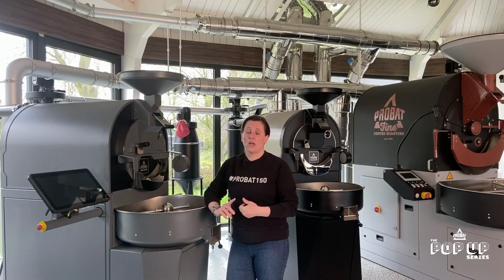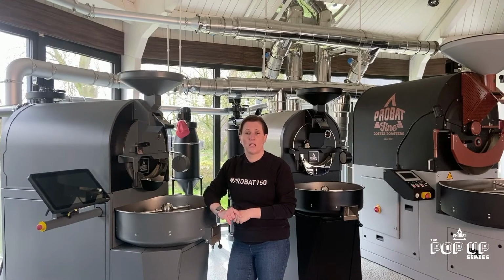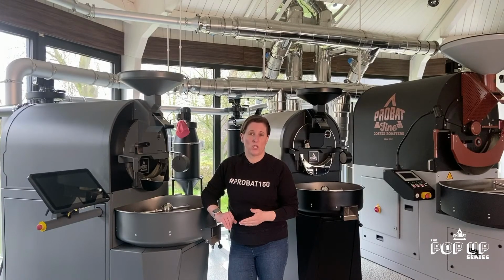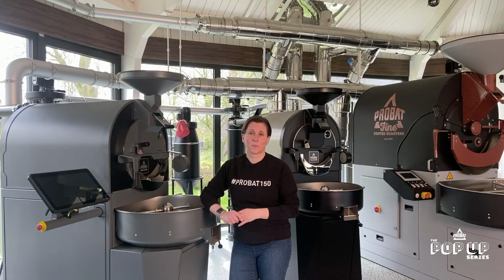Of course, you have to choose the right location for your machine, and there are a lot of different things you have to take care of. These machines are all quite heavy due to the material that we use, so make sure that you have a nice and stable ground where you place your machine. There are also possibilities to move the machines some levels up. Also here, make sure, and later on we will get to this point when we talk a little bit more, you have the right equipment to bring the machine in, and of course the floor needs to be able to carry the weight of the machine.